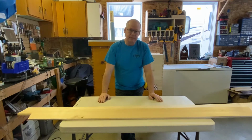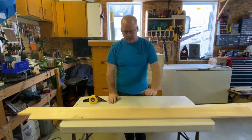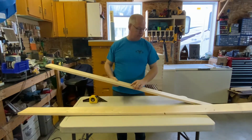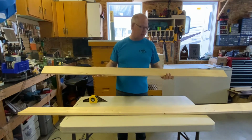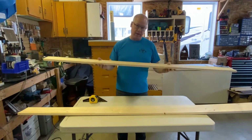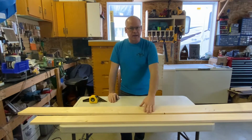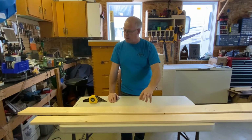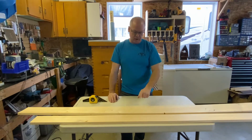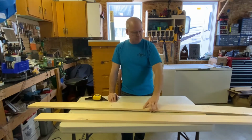So let's get started. We're going to continue to make the outside of our bottom board out of pine. You'll need a 1x4 by 6 today, out of pine. And then we've got some pieces to put on the inside. You're not going to see that as much, and it's not exposed to the weather as much. So I don't have a whole bunch of extra pine. Rather than run to the store, I'm just going to use this piece of spruce that I have here.